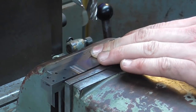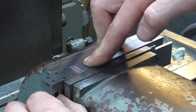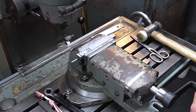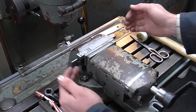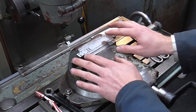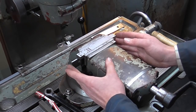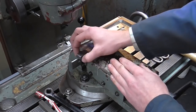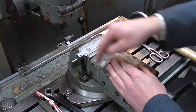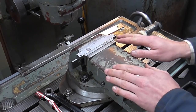I'm leaving just enough overhanging so I can do my edge finding on both axes. Normally of course you would mallet this down, but as you may have noticed I've had to do a little bit of rearranging. I'm drilling close to the edges so I can't afford a parallel on either side. Were this a solid piece of material I would have just had both parallels out, but because I've got two pieces I've reshuffled that parallel into the middle — where the drill bits won't hit it — to prevent the bottom piece being pushed down if it's slightly narrower than the top.